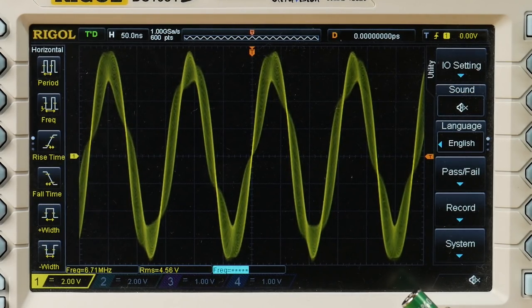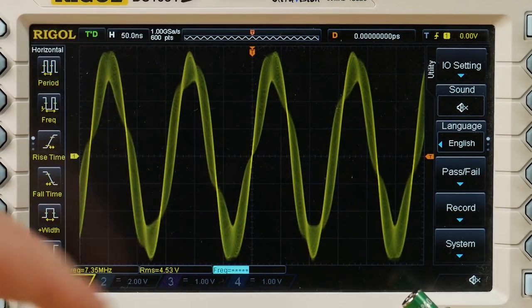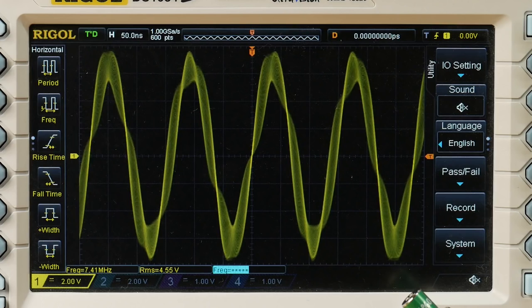So one of the benefits of having the board be designed this way is that if you want to use this subsampling effect to capture out-of-band signals, you certainly can do. It can be useful in some cases to be able to capture these signals in this way. No, the frequency is not a reflection of the true frequency directly, but it can be quite useful still to get a subsampled version of the input frequency. Or, for example, you can attach an input filter of your own external to the A2D board to make sure that you're not accepting any tone into the A2D that you don't truly want.